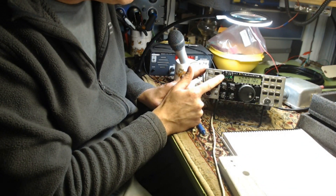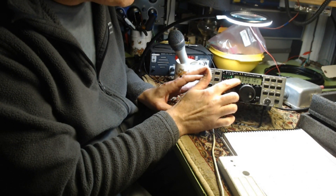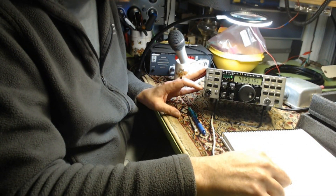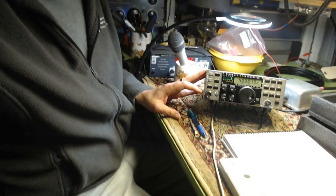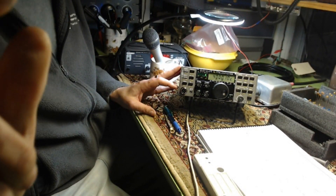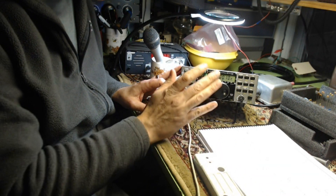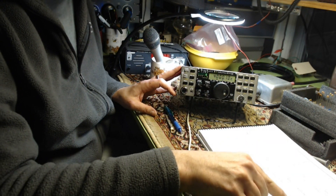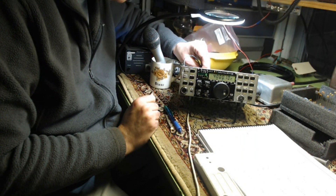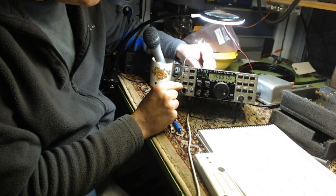Using the band selection, I put it into 80 meters, and I have it set at 4000.10, which is what the manual tells you to do. I'm going to read this and do this on camera. So I have that set where the book said to. Connect the frequency counter probe to the test point TP1 and activate the counter again, as I did before. I'm on TP1 — you won't see any change there. I have to turn on the probe again.